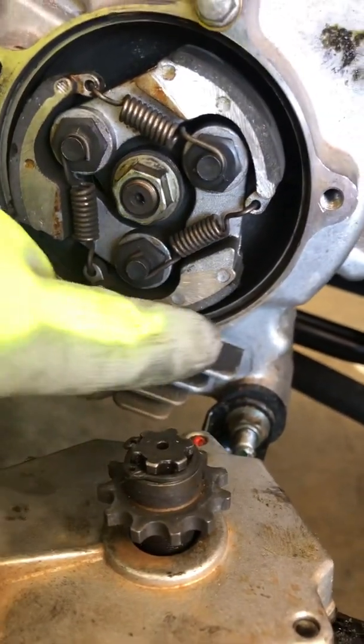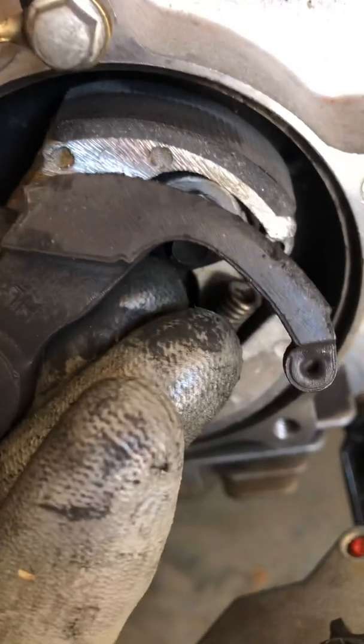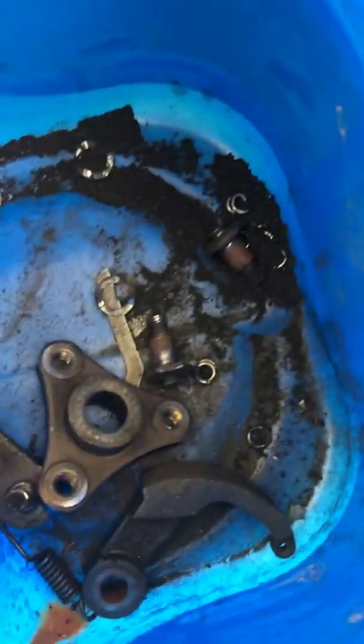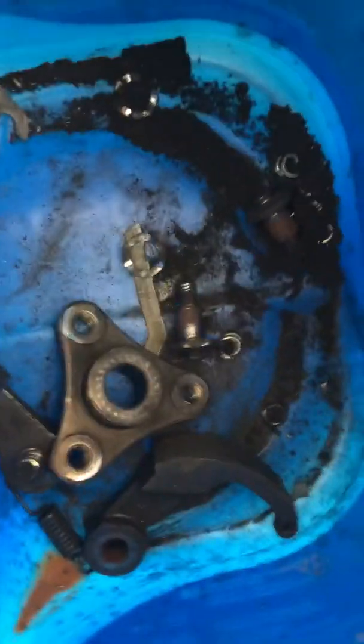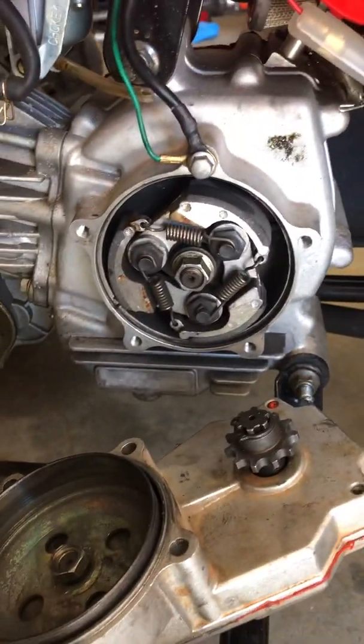What happened was the spring broke and actually got caught down in here between the pads, grinding away, breaking into pieces. I had to round off all these pads — as you can see, there's no pad left on the top of that one, kind of like a disc brake pad with almost nothing left on it, completely ground off. All those little round pieces in there are from the spring that broke and ground down — that's the metal shavings, not dirt.